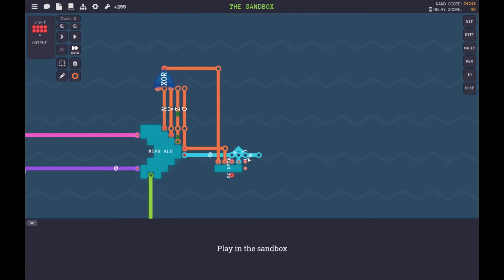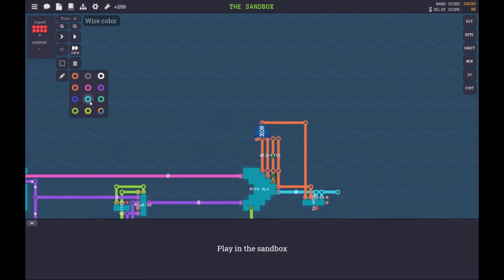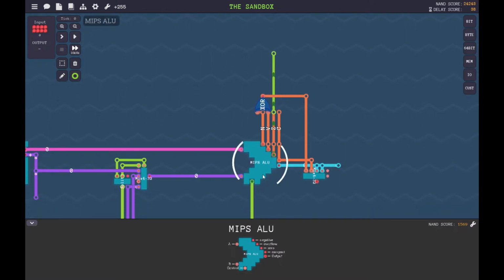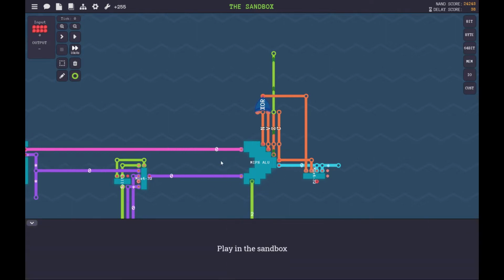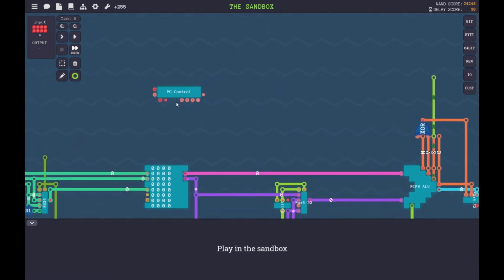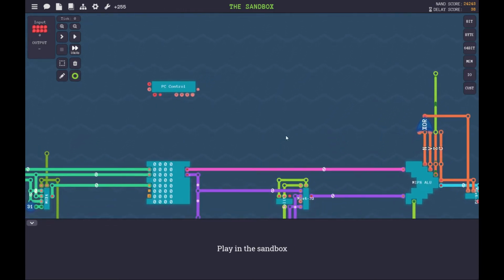And then in either of the cases where we're not doing a set less than operation, we don't care whether the operation was signed or not, we want to return the ALU results. So we want to connect the ALU result to both of these pins. The 0 isn't used for determining these things. The 0 is useful because when you do subtraction, as I mentioned earlier, the 0 line only comes on if the values were equal, and we're going to want to connect that to our program counter controller over here, which we will wire up later.